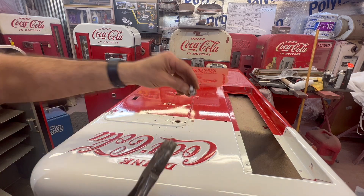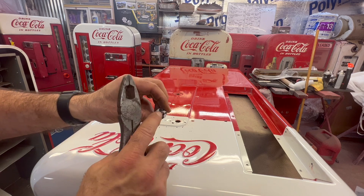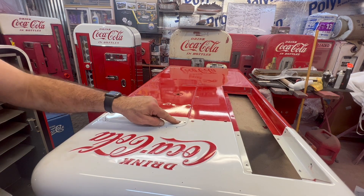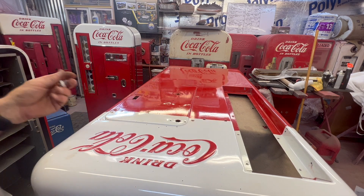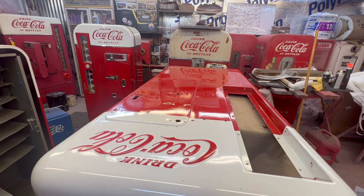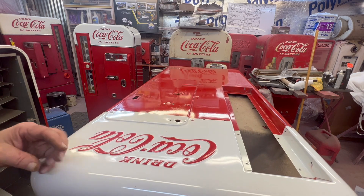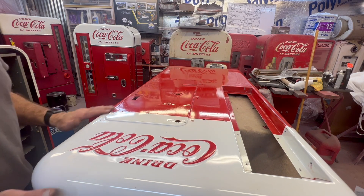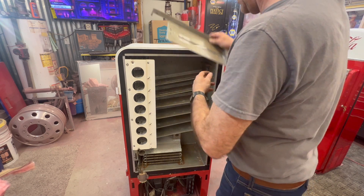From the inside you pinch this down - that little wire mechanism hung down here into the coin mech area and kept a little heat in there. So if there was any moisture in there, that heat would keep that coin mech working even in freezing temperatures. Door is done. Next thing - go ahead and take the shelves out, get them all done.